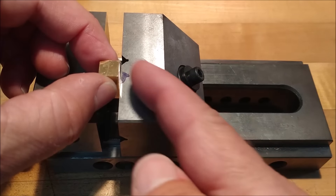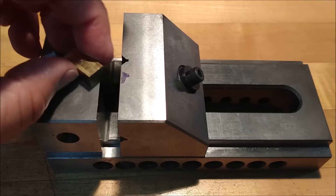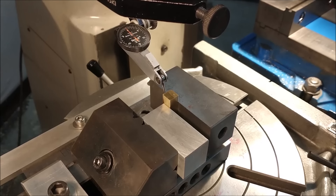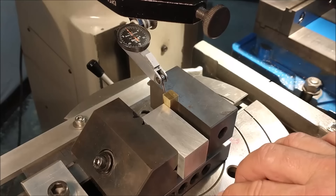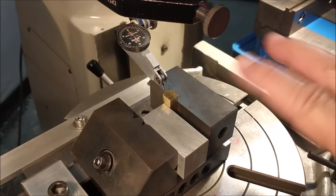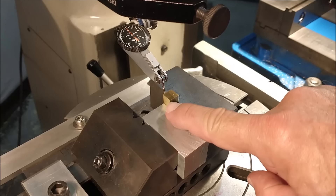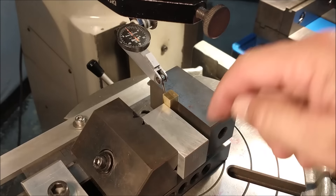Let me set this up, square this up. We'll put this on the rotary table, pick up some edges, pop a hole, and keep on going. My first step is the initial positioning of the part vise on the rotary table — vise parallel to my back rail, everything set on zero rotationally, with a helper block pressing the brass blank against the stationary jaw.